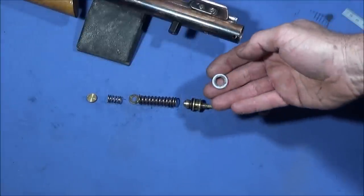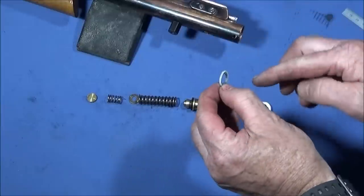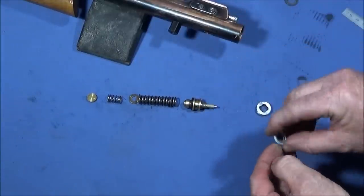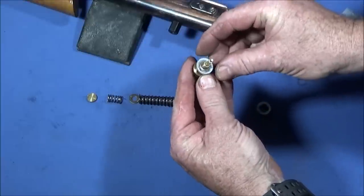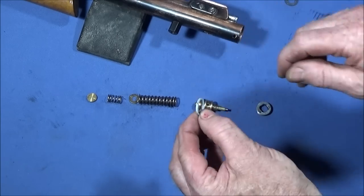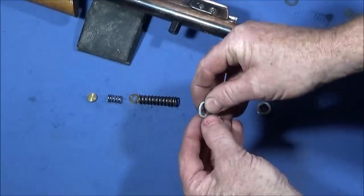And if you make a load of these up all at once, you can actually make them by doing the bore exactly the same diameter as the lead one, and that actually fits on the back of the housing like that, and when it's screwed together it seals every time. But because it's crushed when it's pushed together, that's why you have to actually make a new one.